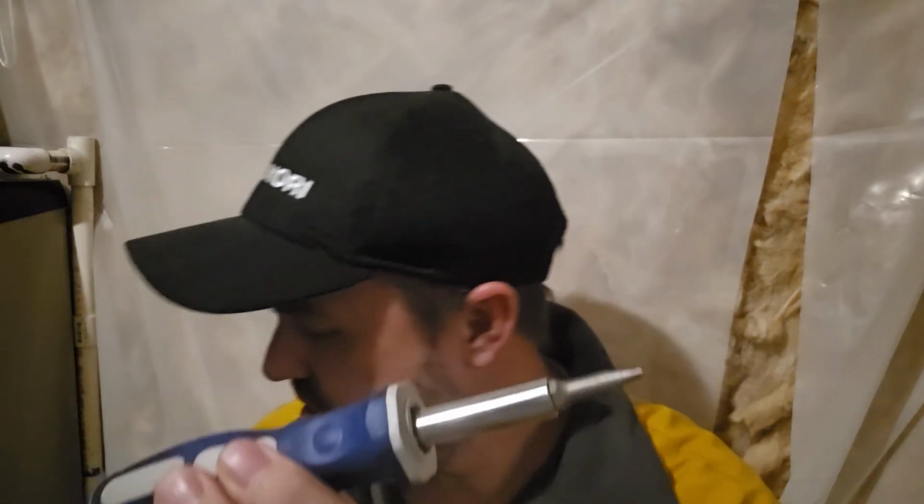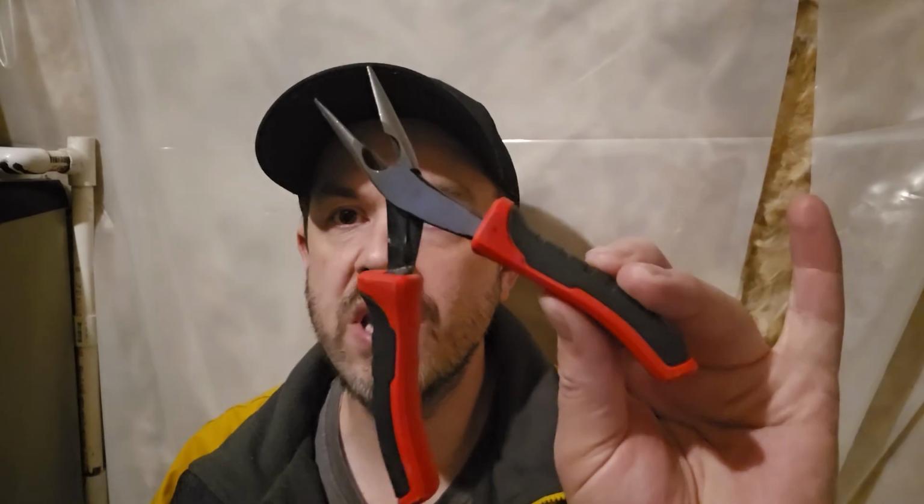You're going to need a screwdriver. Make sure it's an insulated handle because you're going to use this to discharge the capacitor. So when we pull out the new one, we're going to touch the electrodes with the screwdriver to discharge them to ensure that that's safe. You're going to need some needle nose pliers, totally optional. Primarily this makes you look more professional, but you may need them to help remove the leads that are connected to the capacitor.